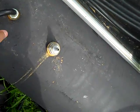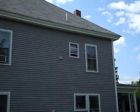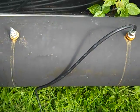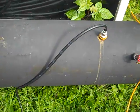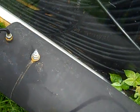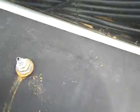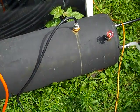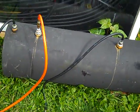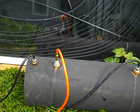I did have it running like a regular water heater where cold water coming in creates pressure to push the hot water out through a garden hose into the main house. But the problem is with about 40 gallons of hot water in there, the cold water coming in would dilute and cool it off very quickly. So what I did is I ran an air hose with a little stem that reaches all the way to the bottom of the tank. Compressed air creates pressure inside the tank — about 60 psi — and that pushes the water down and out, meaning every drop is as warm as the one before it.